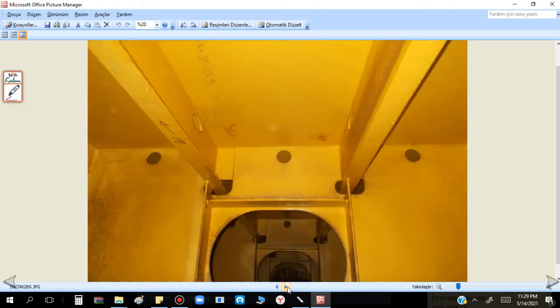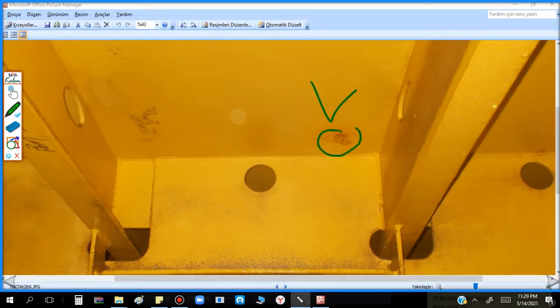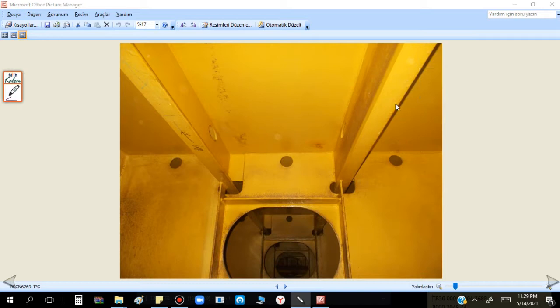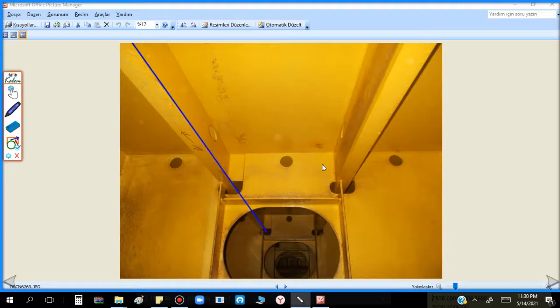This is the floor, this is the ceiling — up is tank top, cargo hold. This is the underside of the tank top steel. We always check — for example, because in the tank top inside the cargo hold, some cargo can hit from the top and then have some rust area here. This is also important. We check the longitudinals — if they are straight, no waving. You see it is directly straight — no problem here. No slight wave.